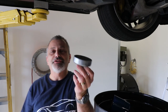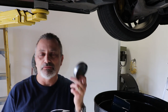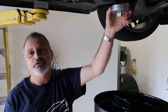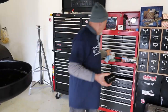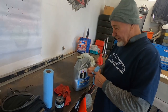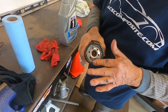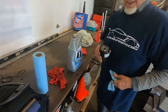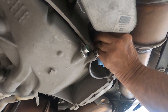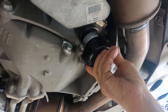This one right here I've had for years — it's a metal wrench. The other one that fit on the socket was a plastic one, but you can pick these up at AutoZone, O'Reilly's, pretty much any place that sells oil filters. This makes your life so much easier because you're going straight up and down, not trying to use the traditional wrench. For the new filter, getting ready to put it in, you want to put a little oil on the ring just to make sure it gets a nice seal — just stick your finger in there, that's all you need. Put it on the gasket, it just makes it seal nicer. Some people do it, some people don't, but if you don't you take the chance of ruining the gasket. Make sure everything up here is dry and clean of all debris, then it's real easy — just stick it up there and get it started.